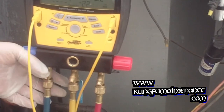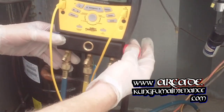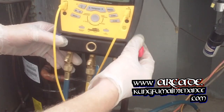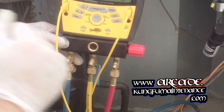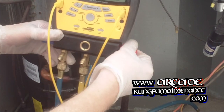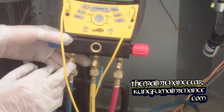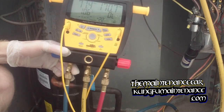What we need to do is drag this over into the system. We're going to open our line here and just meter it in, letting the refrigerant come up and over and down into the low side. We'll listen to the compressor, and if it starts suffering at all, we'll just close the line back off and let it bleed over little by little. I can even feel the refrigerant — the line gets nice and cold as it's being drawn over.